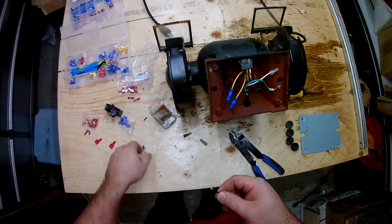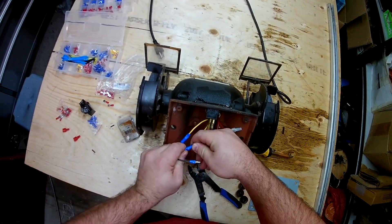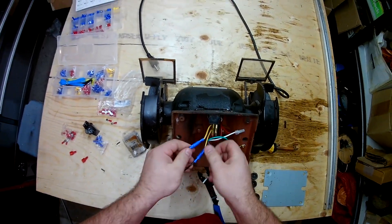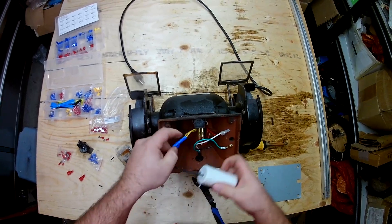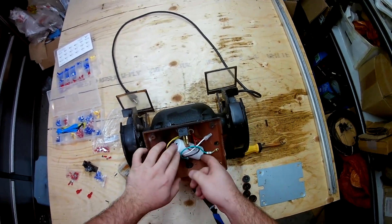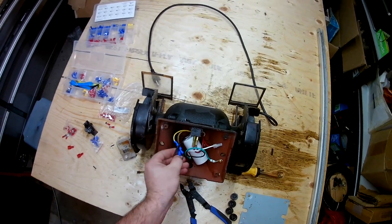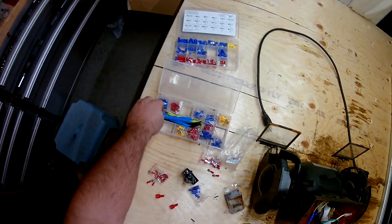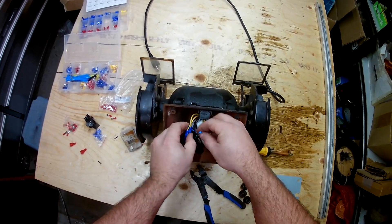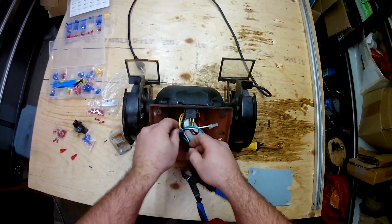Same crimp and cinch up on the connectors there. These aren't polarized, so it doesn't really matter which way you connect them. Just slide that right into there — it fits pretty good, lots of space around still, so no issues. I'm just going to bundle those wires together to make sure that through its life, there's not going to be any vibrations and movements causing it to rub against the casing, expose some wires, and short it out. I always like to keep things nice and tidy.